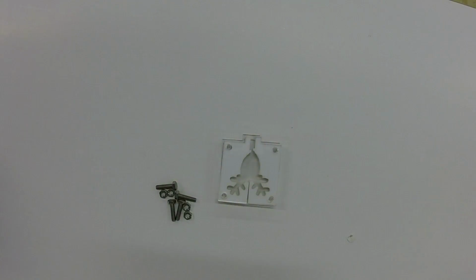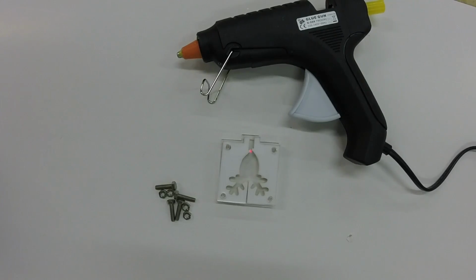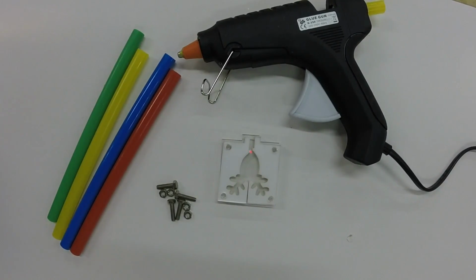The next important thing that you need for the glue gun injection moulding is the glue gun itself. This is your bog standard low melt glue gun from any of the technology supply places that you use, Rapid, Hinley's or Tech Supplies. We found that coloured glue sticks have worked the best. They run better into the mould itself. Clear have left a lot of air pockets or bubbles or caused the mould to burn and set too easily.